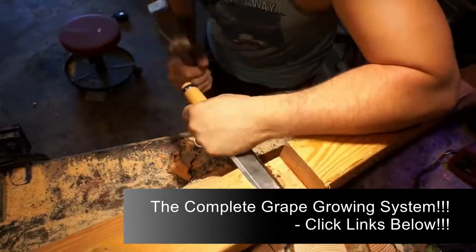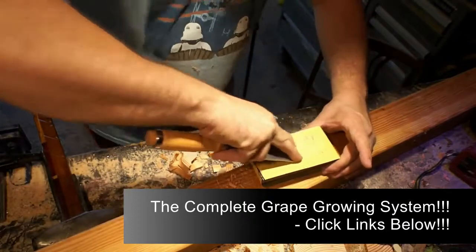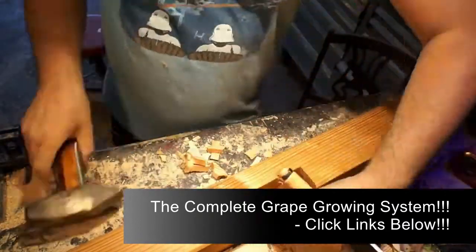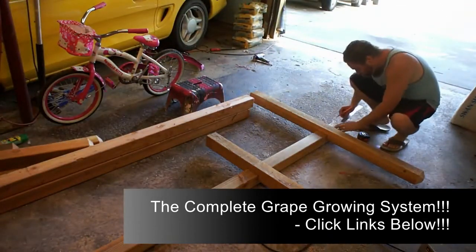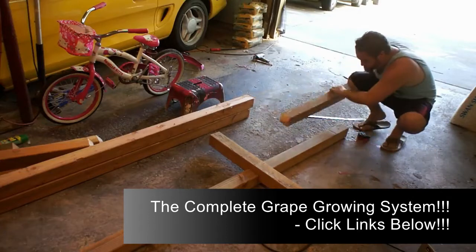I was going through this, I found that it was a little bit easier to take the chisel and go right exactly where I wanted the chips to break out on both sides, kind of score it with the chisel so there's a natural stress fracture for it to go through. Then when I started hitting it with the hammer and doing the chisel through on the other side, it broke away a lot cleaner.